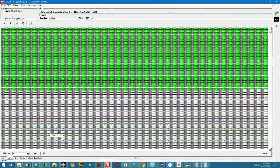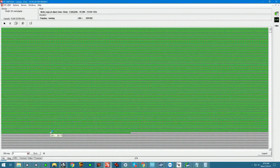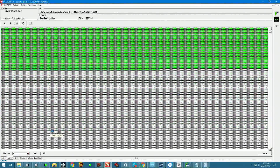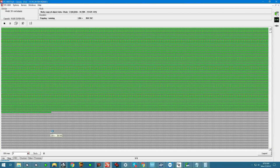So in this case, I would go and build a map of all of the used sectors. And once that's built, you've got to clone it out. With the clone finished, the case would be considered completed.